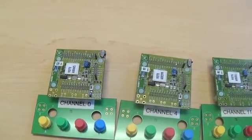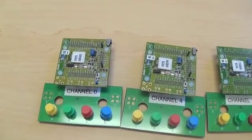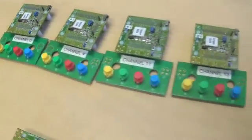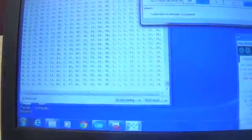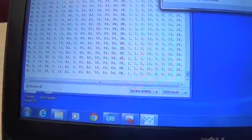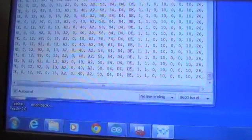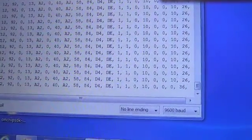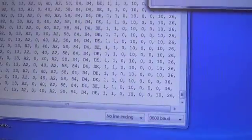When I push this button, it is continuously transmitting a tone on channel 0. Let me go back and observe that the Zigbee network is perfectly fine. I'm not interfering on its channel, and so it keeps updating once a second. I can push the button and see that it still has no problem reading its sensor and sending its data.